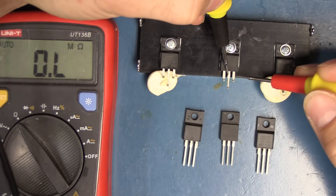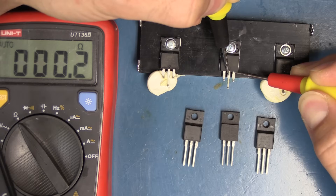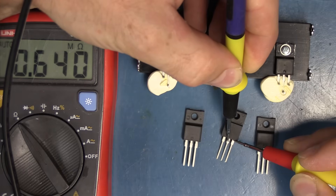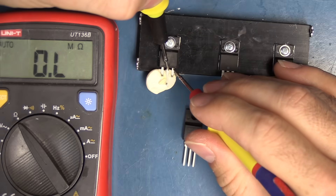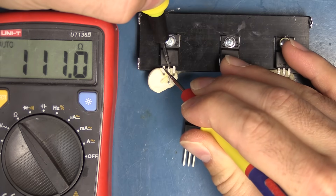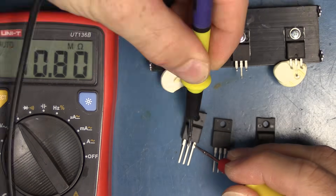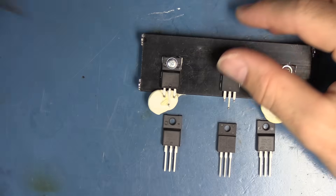I am no longer in beep mode — I am now in resistance mode, and we're going to do a comparison. This is our center diode, and it's showing zero ohms — 0.6. Our replacement is showing 0.64 mega ohms, which is 641,000 ohms. And then this one over here — zero ohms. Obviously, that's a problem, and 111 ohms on the other leg. On our good replacement, we have 10.8 mega ohms on one leg, and the other should be open — and it is.